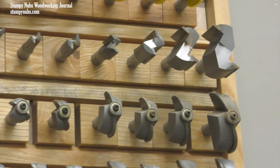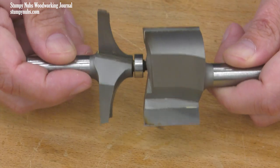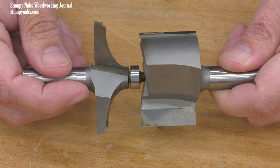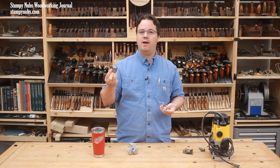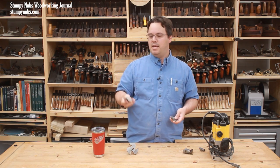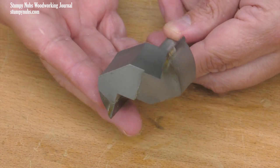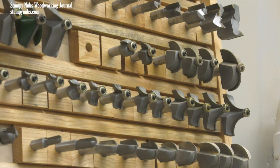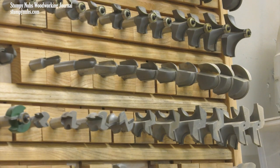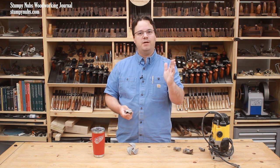These large profile bits are relatively light for their size — they weigh just under four ounces. On the other hand, this two inch straight bit weighs more than twice as much at nine ounces. Even though this straight bit is smaller in diameter than the table edge bit and well within the range considered safe for a handheld router, I still consider it sketchy at best handheld because it has so much mass — and that's something I rarely hear people discuss. Heavy bits like this one, or large box cores, roundovers, and big bullnose bits, can present their own issues because all that extra weight can combine with any run out in your router spindle and cause micro-vibrations.